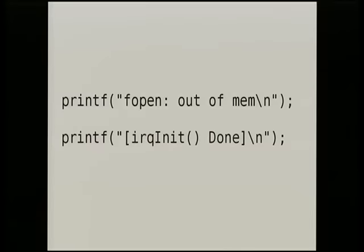So I started disassembling the ROM of this, a 4-meg ROM, and that's a puzzle inside a puzzle. So we recurse here, pop, push. And there were all sorts of statements like this which made disassembling it a little bit easier. The first thing I wanted to do was find the serial port, get some debug out, and find the memory map, figure out where the MMIO registers were so that I could actually program the peripherals on this thing. So start early, and I found a message in the ROM that I saw was printed out when it first started up. That's going to be their equivalent of their early debug printf. Referencing that, I found that function. It starts playing with some MMIO registers, and sure enough, that's the UART. So I've got my debug output there.